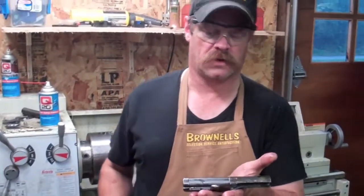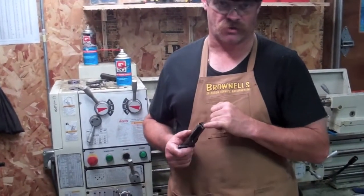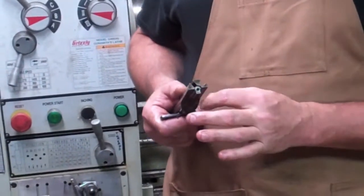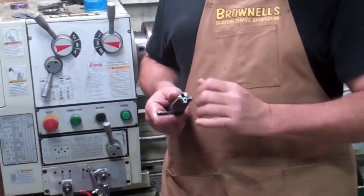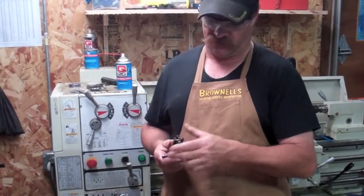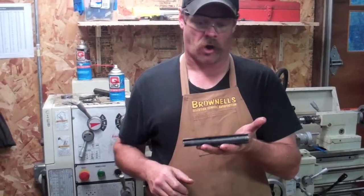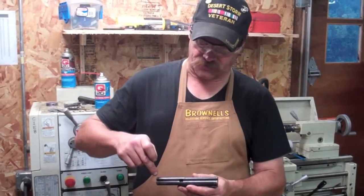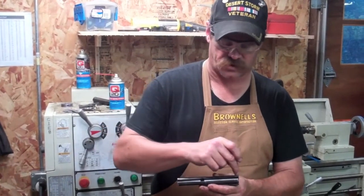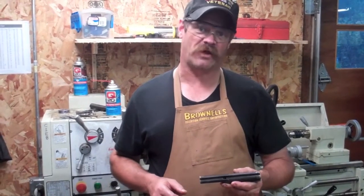That's how you center drill a long bolt like this to make a firing pin. There are several other steps still needed. One: I'm going to take this lip off the bottom. Then I'll pick up a stainless steel machine screw at the hardware store, measure the major diameter and thread pitch, drill a hole into the bolt face, remove the old bolt face, tap it, screw the machine bolt in, cut it off and grind it flush, then center drill that — that will be my new stainless steel bolt face. The outside diameter will also have to be turned down, since the full-auto bolt won't fit in the semi-auto receivers. And since there are feed rails in the receiver, I'll need to mill a large slot down the full centerline of the bolt after machining the diameter. If you want to see all those steps, check my other video on Down East Gunworks on YouTube — look for the KP-44 build from scratch.